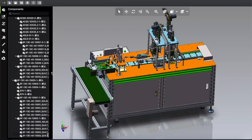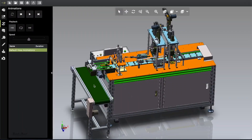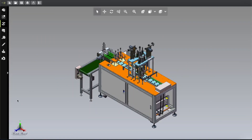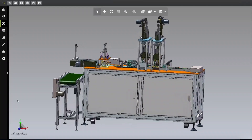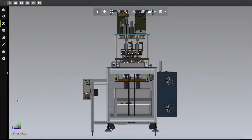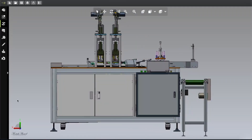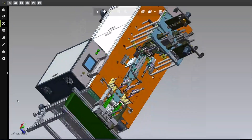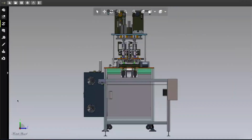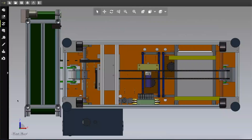Before starting disassembly, let's view this machine from different angles so you can understand how it looks. There is a main automatic sealing unit with two ultrasonics used at the same time. With this machine you can produce around 60 mask pieces per minute.